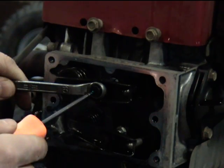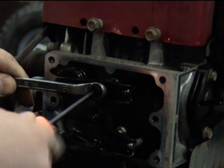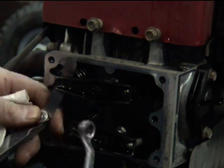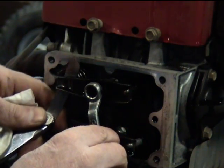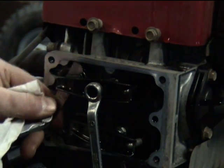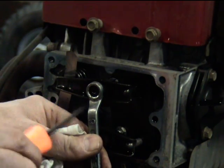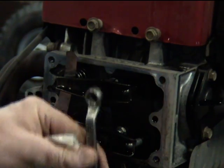While we're holding this, we're going to back that lock screw out a couple of turns. We're going to set our feeler gauge in there and slowly tighten this up until it starts to get tight. Then go ahead and snug that set screw back down. That's what you want it.